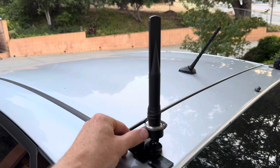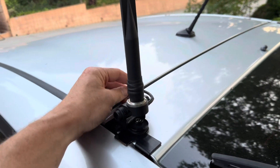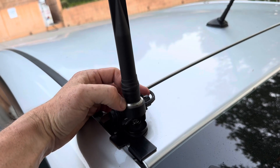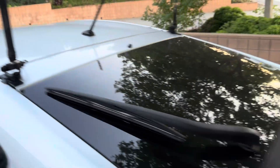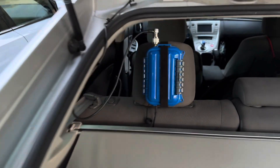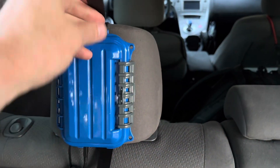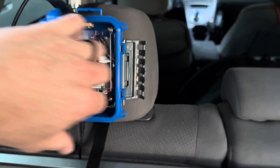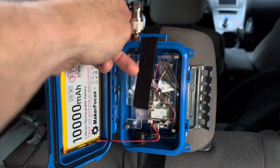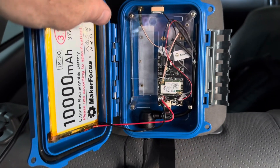It's attached to a Diamond K400 hatchback antenna mount. I used a cable off Amazon — I'll post links below — it's a right-angle bulkhead type N cable to a three-foot section of RG58. Here's the node itself in a Plano ABS waterproof case, and here's the three-foot RG58 cable with another right-angle type N connector, necked down for the bulkhead adapter.